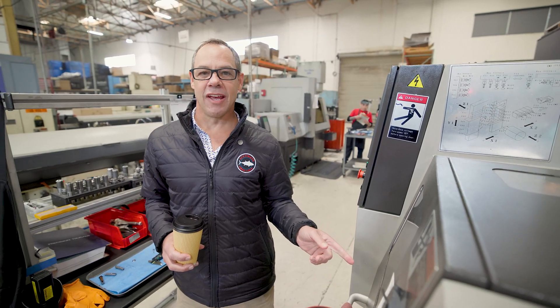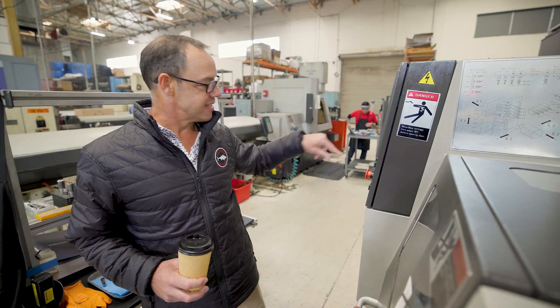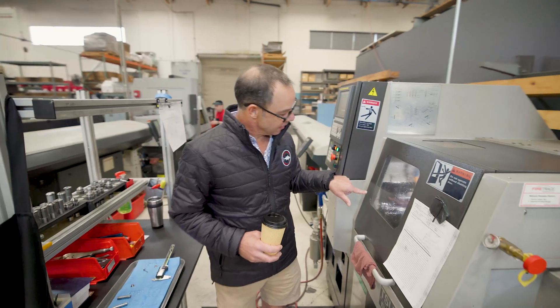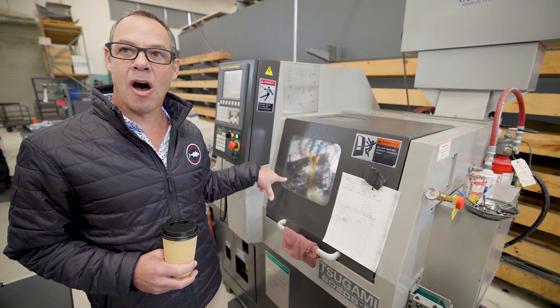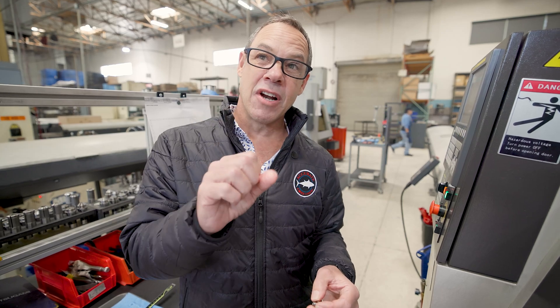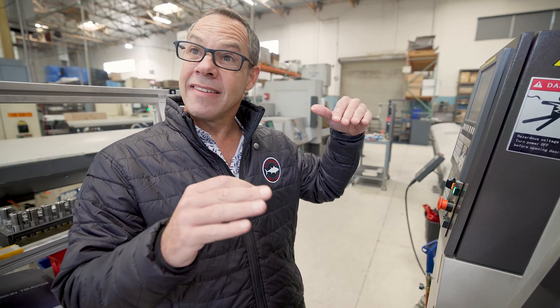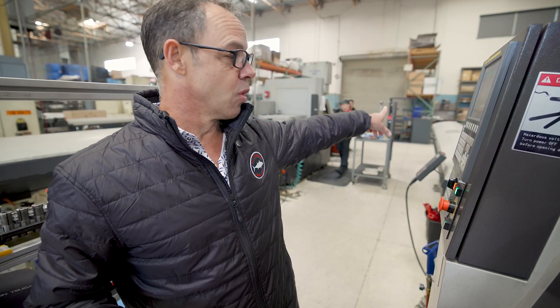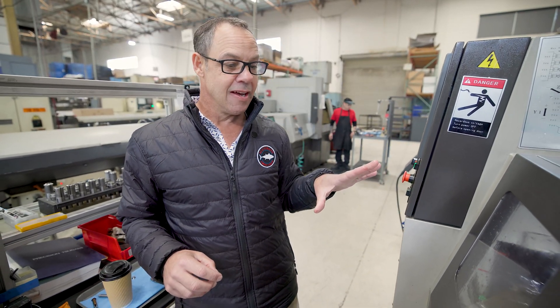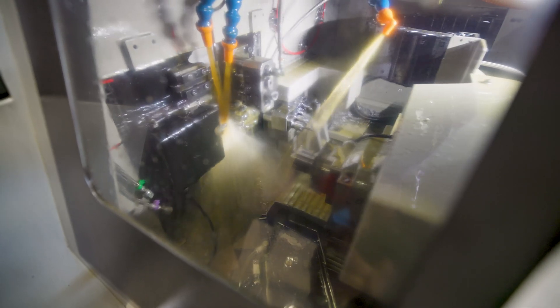This is a 7-axis screw machine. We're making these little screws. There's a 12-foot bar, it's 5/8 diameter that's in this channel right here, and there's some tools performing operations on the bar. The bar is churning at about 7,000 RPM. That is really fast for a machine — you can imagine a bar that's 5/8 diameter spinning at 7,000 RPM. So if there's any vibration or the bar is bent, it'll blow up, it'll actually destroy this whole machine. So it's really critical to make sure you have straight bars that are precision ground and not bent.